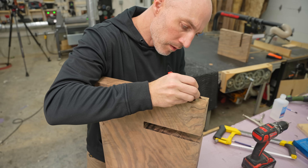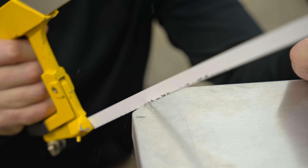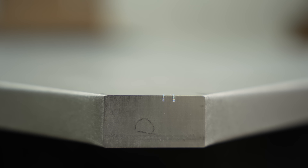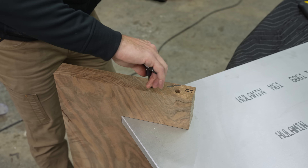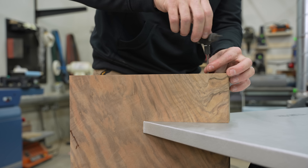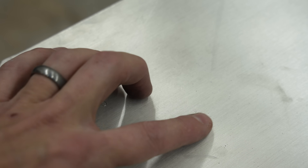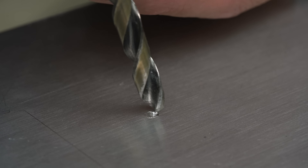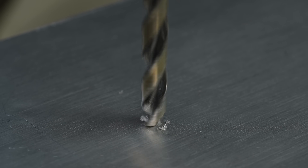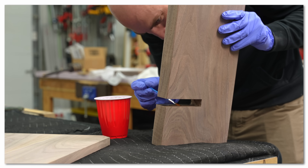All of these legs are going to be very similar but could be off by a couple of millimeters, so I want to marry each leg to each corner. The aluminum still has to be powder coated, so I put little notches in each corner to label them. I put sharpie marks on top of the leg — somewhere you'll never see — to indicate leg number two, so I know it will forever match that corner. I'm using the set screws as a marking device to make sure they go exactly where they need to be. As a trick I learned from some Festool tools: I'm drilling the holes slightly inward from where the set screws are, so as the set screw tightens, it pulls the leg even tighter into the shelf.